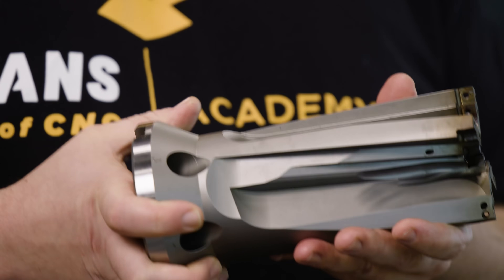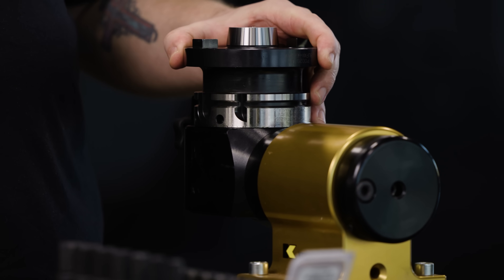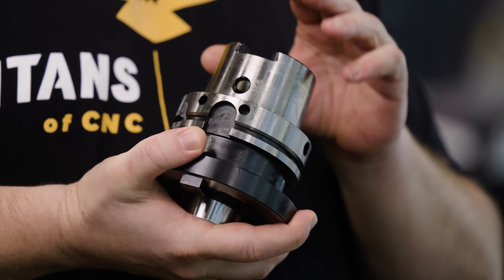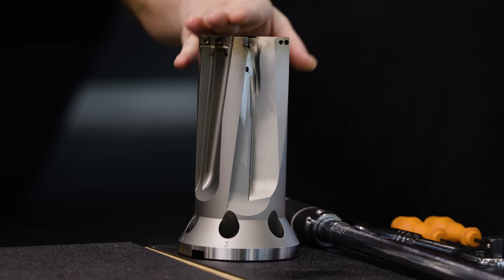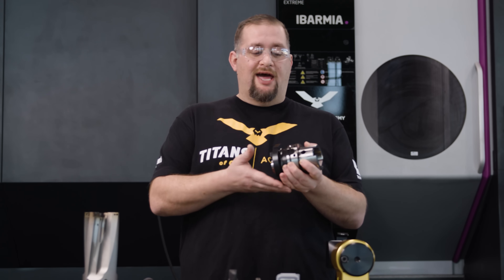In addition to this being an amazing cutting tool, we're adding in the flexibility of Kennametal's BTF-46 adapter system. What this adapter system allows you to do is use several different styles of spindle connection types. So we can use this same drill on an HSK-100 spindle connection or a CAT-50 spindle connection — you just have to buy the different adapter.